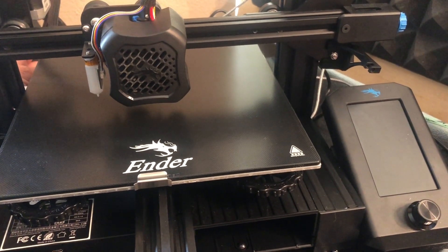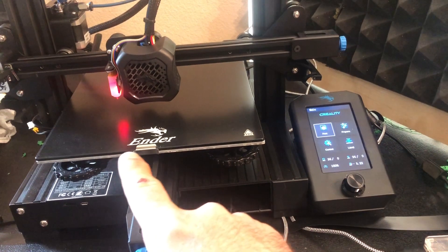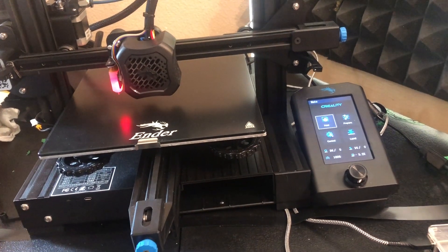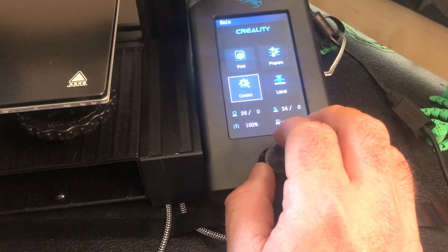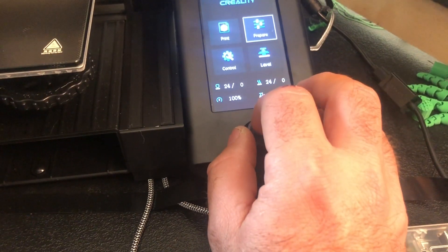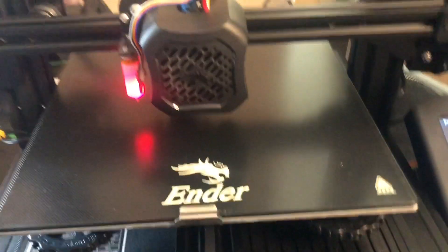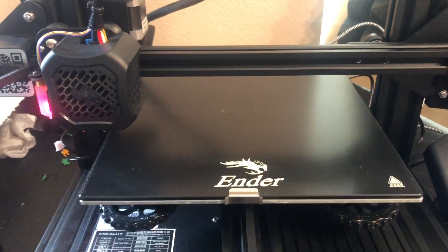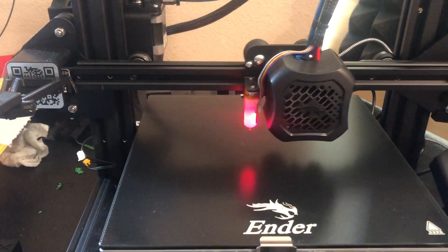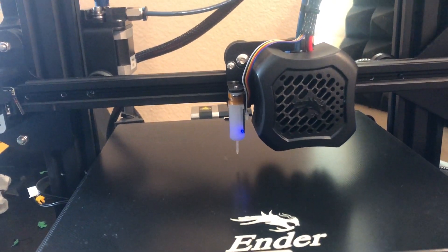Smith 3D has a guide that helps you install it. Once you get firmware installed and turn the printer on, you'll notice the probe lights up, drops the probe twice, then fires up. With Smith 3D you get a neat white line around the icons making them easier to see, plus a level button. For other newbies — when you hit auto home now that you have a probe, it's not going to move straight to zero-zero. It'll find its X and Y, then probe for Z, which I thought was an error but it's perfectly normal.